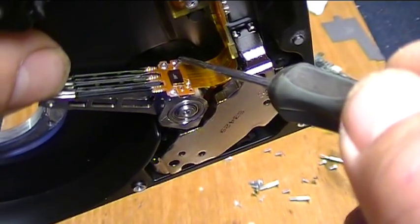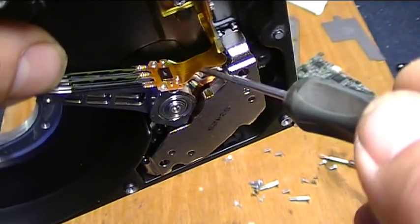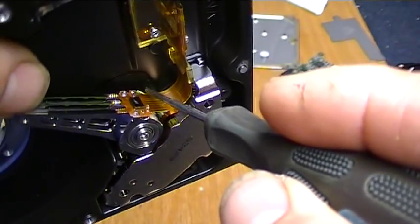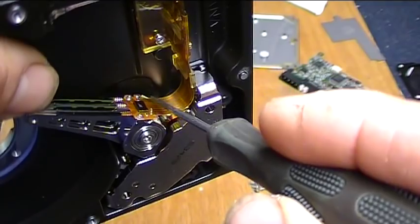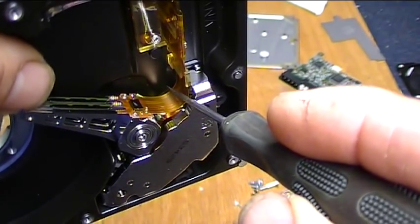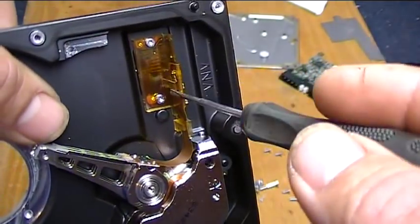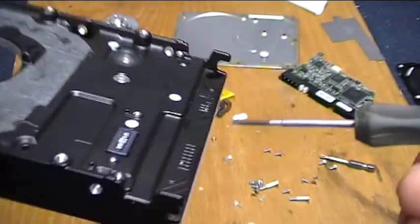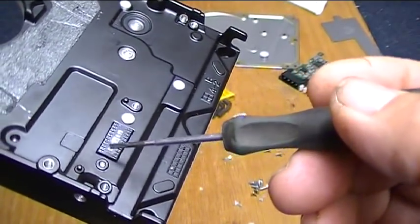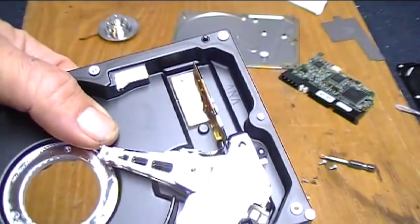and then those 2 wires connect to a strip right here, a copper strip on this flexible PCB, and they run along the bottom here parallel. So it's the first 2 traces on the bottom that I need to find over here somewhere and get the pinouts, and potentially through to the other side, and I can find the pinouts here and tap into them there for my input.